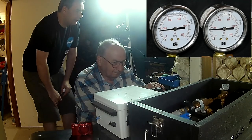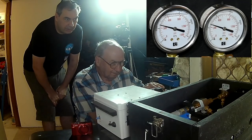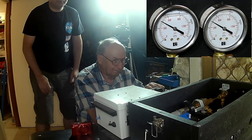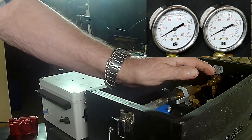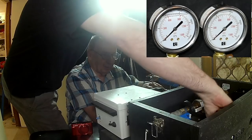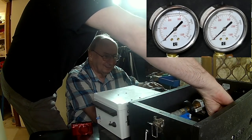Pressure at 200, 300, 400 PSI. We then had an issue — we forgot to tighten the high pressure hose into the launcher itself and the o-ring popped out. The quick fix was to tighten the hose and we were ready to continue with the test.